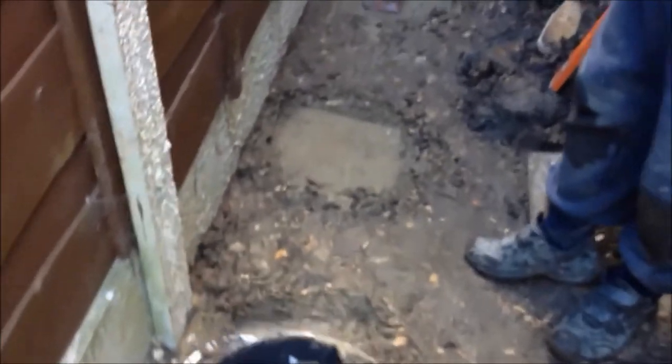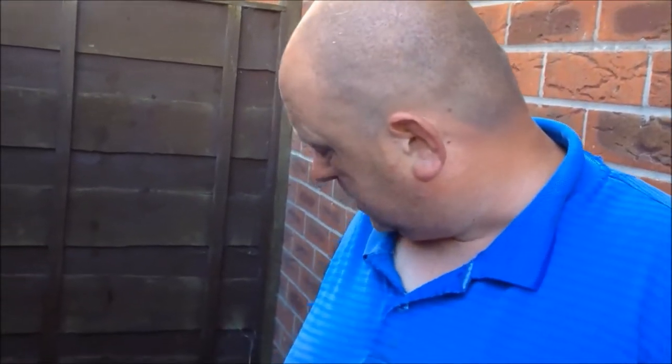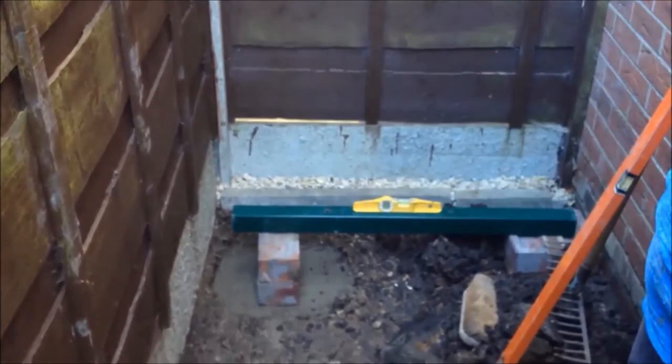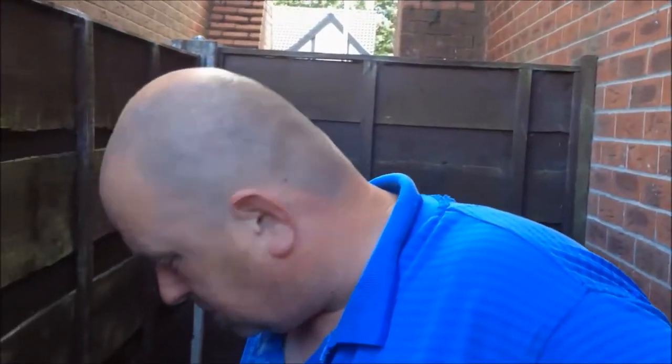Right, well we've got three little pads in on the other side. Mrs. H has pushed the job on. Wasn't taking no for an answer. So once those have set, we'll do the same thing as I've done on this side, build three piers on there. And as you can see at the back there, that metal bar across, I'll put two more in. By that point, those will be level. And then our floor will go on and that'll be a solid job. Should never shift, last 1,000 years. What I will say is, I pity the poor bugger who has to take them out. Probably be me, won't it, when we move in this house at some point.